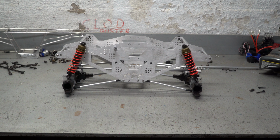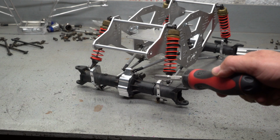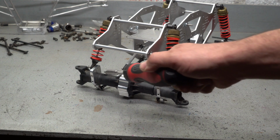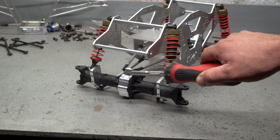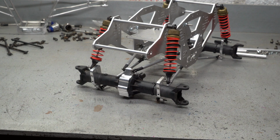And then I remembered I was watching a video from XOKJRC, and I saw these axles he did. So these are just like his. These are factory Kyosho Madforce axles, but normally one side's a lot longer than the other. So I just cut this inner axle tube and that narrowed it, so now they're both the same length, so they'll use the same axle shaft on both sides. And I bought the centerpiece, which is the upper link mount, and the outer shock mount, which has a lower link mount, and those are from Freestyle RC. So again, I gotta thank XOKJRC, awesome channel. I never would have known about that if it wasn't for him.